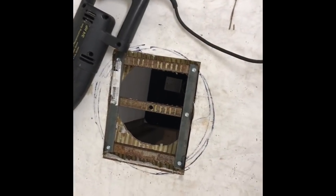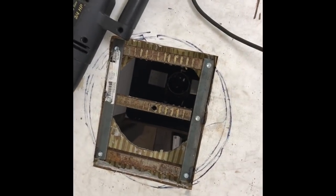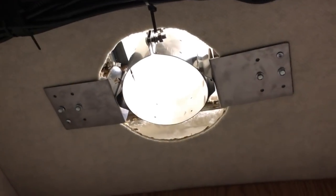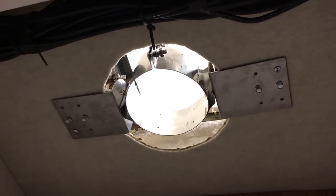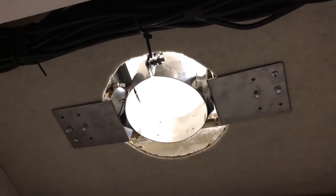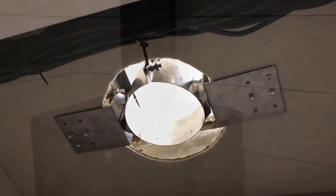I got that center piece bridged and I'm going to cut out the center piece, then get my bracket in. We got that cut out, and it's supported really nicely — ready to put the bracket in. I got the bracket in. The material up there wasn't as thick as I was hoping, so I used long four-inch self-tapping screws, drove them through the flimsy material and into the steel tube up there. That bracket is set and now I'm going to put the stove in and get the insulated pipe installed.